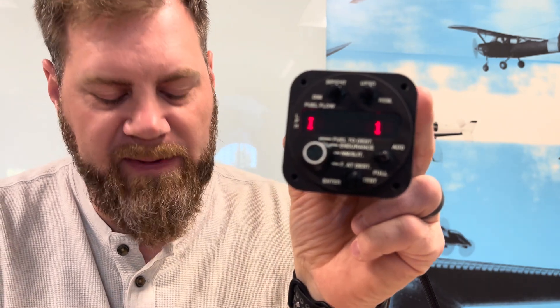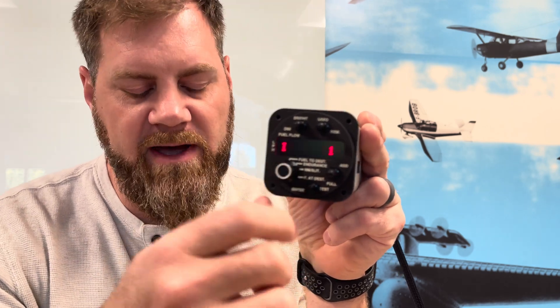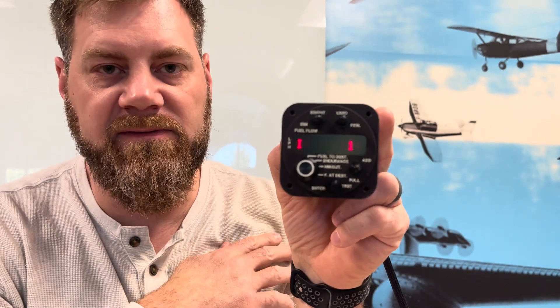The next value is 'I' — GPS/Loran input type. From the factory this is set to 1 and it should always be 1. It's always expecting a GPS input whether or not it's wired. When using the rotary knob, the only mode that will work without a GPS is Endurance — all other modes depend on a GPS input. If you don't have GPS input, leave the knob in Endurance. If you do have GPS, set I=1 to use that input for track position data.